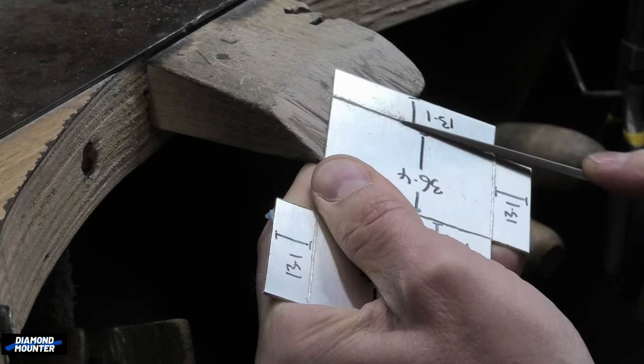I'm going to show you this — I'm not doing an ego flex about how good I am at making hinges. I'm making mistakes — if something goes wrong I'll show you. So I've got to carefully cut through the middle; one side I can pull out no problem, but one is soldered in and I have to drill it out. So there's an extra little feature for the video I was hoping I wouldn't have to do. I've cut out that middle section. I'm now going to use a ball bur to dip in the end right in the middle.